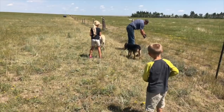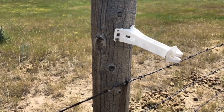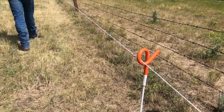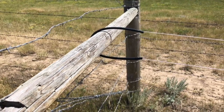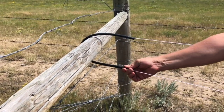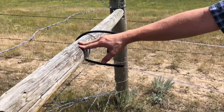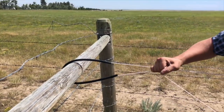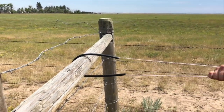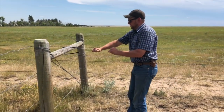If you want to use a wood fence you can use plastic insulator things, which we did prior and they work okay. But because we want to keep the horses farther away from the fence, we opted for these little individual stakes this time. When tying off to something you want to make sure you're insulated — this rubber insulation here will keep this wire off of the fence. Wood is not a very good insulator, especially if it's wet, so it'll ground out your system. Now we're just going to pull it tight because we want this wire to be off the ground.